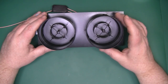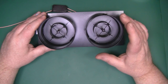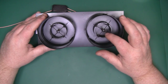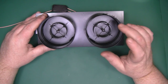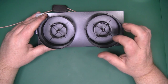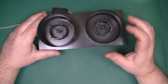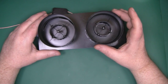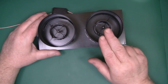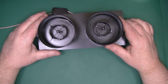In this video I'm going to take a look at the double crosshair antenna. The construction is virtually the same as the single crosshair antenna, so I'm not going to go into too much detail on making the elements. I'll link the previous video in the description. I've also put my own twist on this antenna by using some large soup cans to add waveguides to each of the elements, so we get a little bit more range, although we do lose a little bit of beam width.